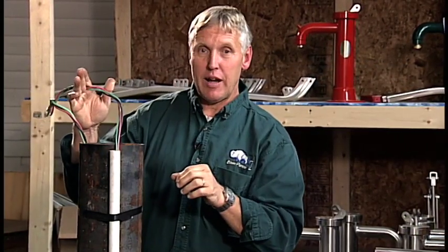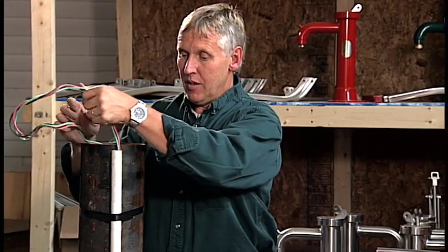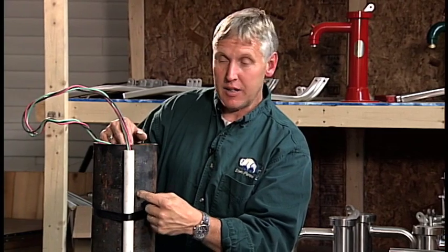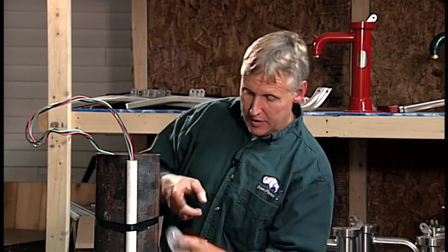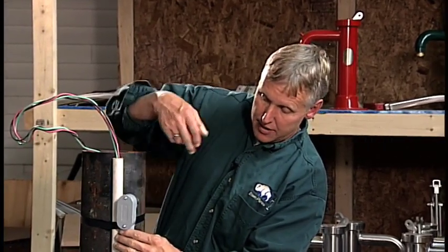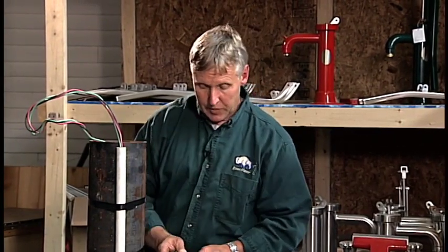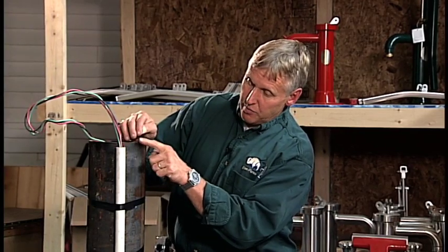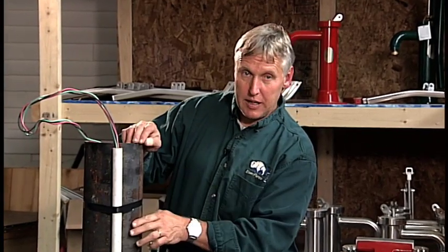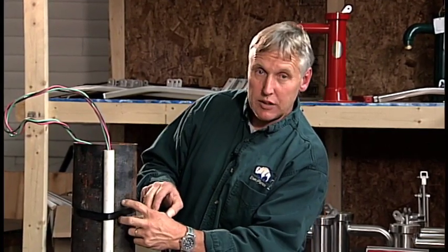You're going to cut the wires with a pair of cutters. Now we can drill a hole in the side of the casing, because we're going to take the wires out from the inside of the casing to the outside, inside this conduit L, and we'll set our conduit L back on the same piece of PVC conduit that goes to your home. We recommend that you go down between 4 and 6 inches from the top of the casing to determine where to drill the hole.